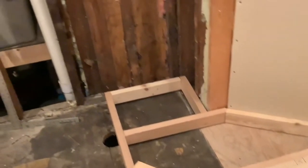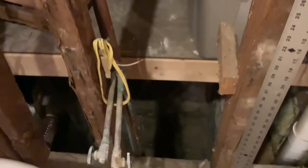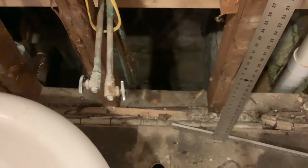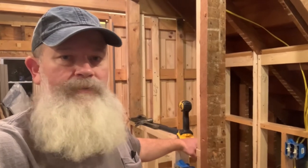Well, that's going to be it for tonight, but don't go away. We still have more to do in the morning, and this video isn't over. We're going to be putting some more wood into this foundation, but it's not going to change much. The next thing is to frame for the half wall that goes behind the vanity. Because this wall is on an 8x8 beam, it's more ideal to go through a secondary wall. I like it best when the plumbing goes through the back of the cabinet rather than the floor of the cabinet. It makes for more room under the sink for storage. See you in the morning.